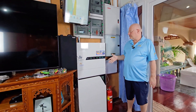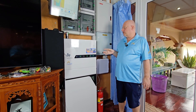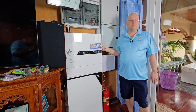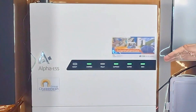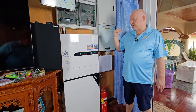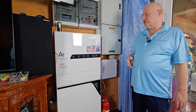This system was released a few years ago, and it really is a very advanced system. You can put up to 16 kilowatt of panels. So even though it's a 10 kilowatt output max, you can oversize with 16 kilowatt of panels. When you're charging the battery, it can utilize more than 10 kilowatt — maybe up to 12. It basically means it is a bigger inverter than 10 kilowatt when you're charging the battery.